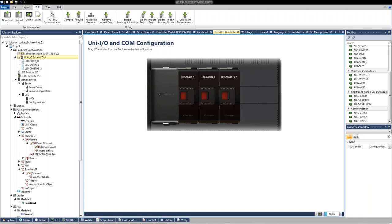So a follow-up on that remote connectivity question. Connecting to a PLC that's on a different network, and that other network doesn't have a fixed IP address. The big problem there is you're not going to know what the IP address is at that location unless somebody is able to verify that. So if you have somebody on site, you can say, hey, what's your external IP address right now? They can check it and tell you what it is, and now you'll be able to connect.